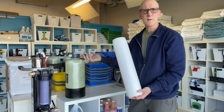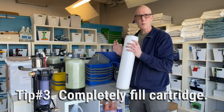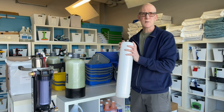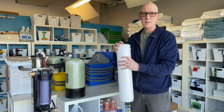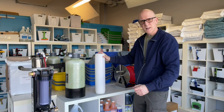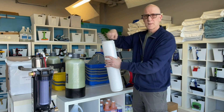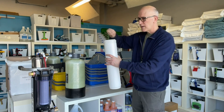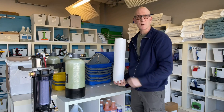A sister tip to keeping it upright is, especially when using a cartridge, make sure you're putting as much resin in as possible. Screw off the cap and put in the resin. After every few scoops, tap it on a hard surface to get the DI resin to settle. You can even sprinkle some water on top to help it settle a little bit more, then scoop more resin in before you close it up and put it into your housing.